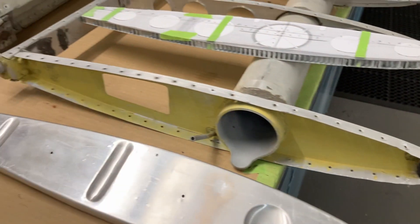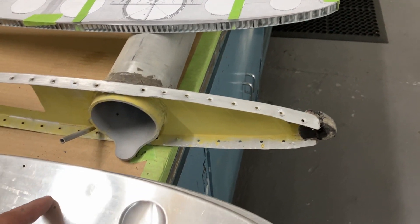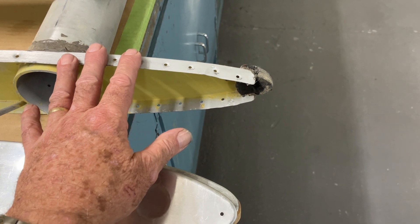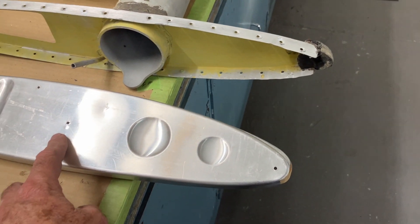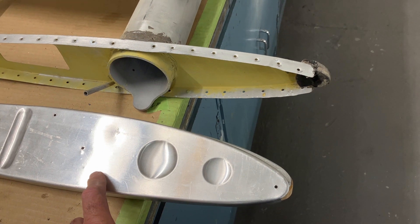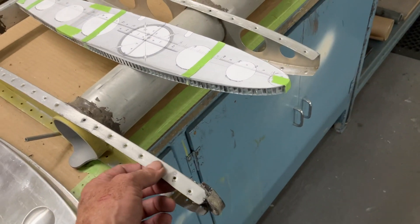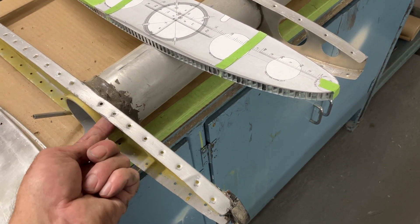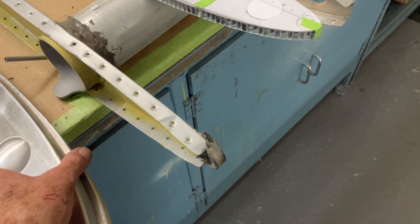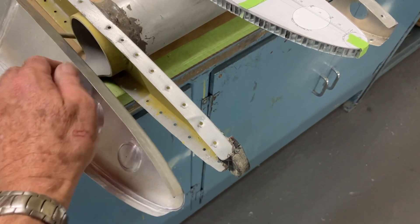Here's the standard leading edge or standard profile. This can be taken right off and the new one replaced, or I could actually cut here where the spar is and just replace the nose section, which I would do if I wanted to save time. I've also stiffened these to a thicker condition — thicker skin than the standard ribs — so that will help to support the heaviest gauge skin better. We've gone up to 25 thou on those.